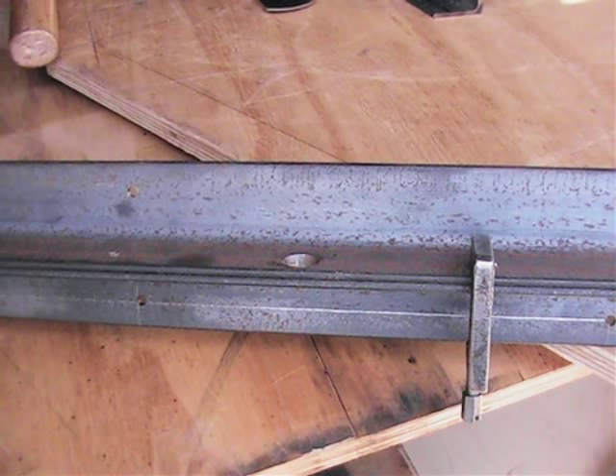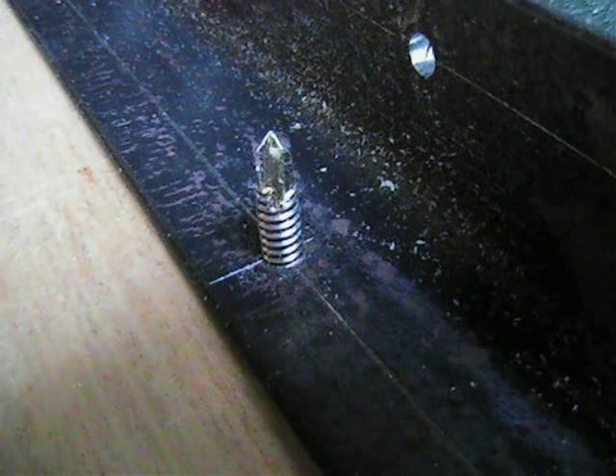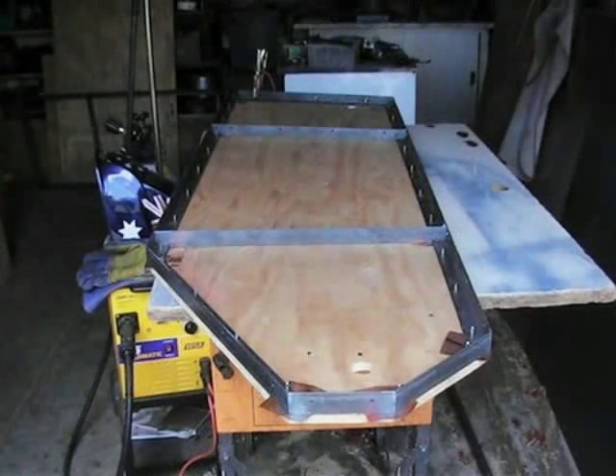You may also have noticed that there is a series of small holes in both faces of the angles at various locations. These are pilot holes for the countersunk metal screws that will hold the panels to the frame. The location and spacing of these holes is not critical, so I shall leave their location to your discretion — usually spaced about 150 to 200mm apart — and again being pre-drilled before the frame is welded together.